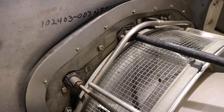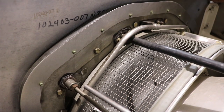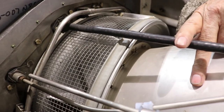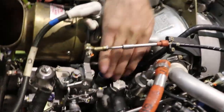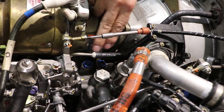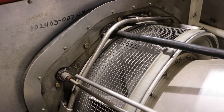This is the P3 line heater. What this does is at high altitude, there's a little moisture in the air, and what will happen is you'll get crystallization in this line. So they attach — see the electrical lead right here? It's basically a toaster heater. It heats this line up and that prevents crystallization from going forward into the rest of your torque limiter and your fuel control.